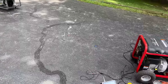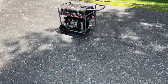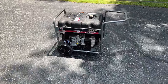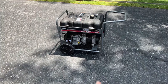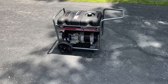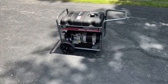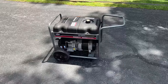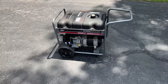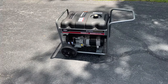Now, this one over here, I am really not sure what caused it to lose magnetism. I mean, someone was definitely in there doing stuff they shouldn't. The brushes looked damaged, not broken. I think someone actually filed those brushes the way that they were. The bridge rectifier wasn't bad. And of course we had that mystery wire inside the control panel. So somebody did something. Whether that caused the loss of magnetism, it's really hard to say.